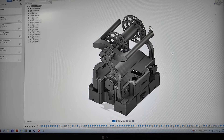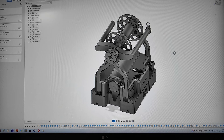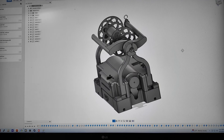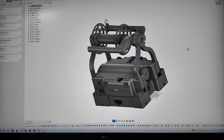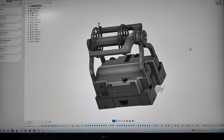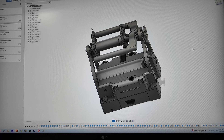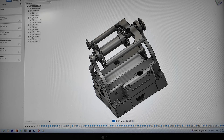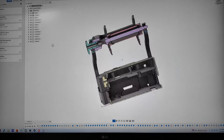The molds are big blocks of steel with the shape of the part being made cut out of the steel block. That void in the steel gets injected with plastic. Cutting all the metal out is usually started with a CNC machine, which grinds away parts of the steel mold. After that, a second pass is usually done with EDM, or electrical discharge machining. This process basically uses very high voltage and current to vaporize parts of the metal in a way that is more precise than CNC.